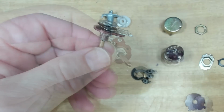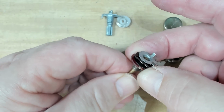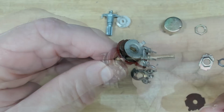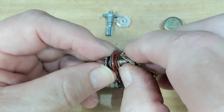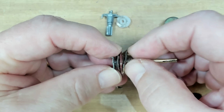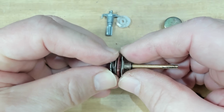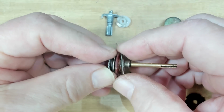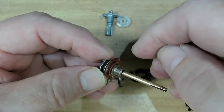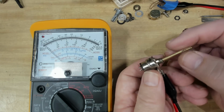There it is. It's a little hard to test without the cap on because it all sort of holds itself together. So I'll put the cap on and then I'll run a test on it. Looks like I've made a mistake here. The little land that I've left there to reinforce that center bit is holding this top plate off the phenolic sheet there. So it won't sit down. I can't put the case on. So I will take this apart. I'll go and just machine that off flat. I removed that little land I had there and now it's sitting down flat.